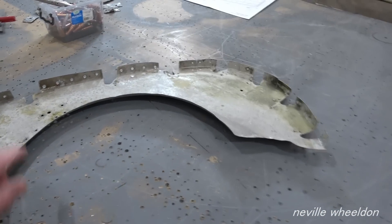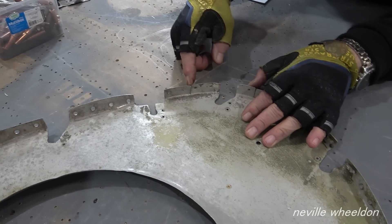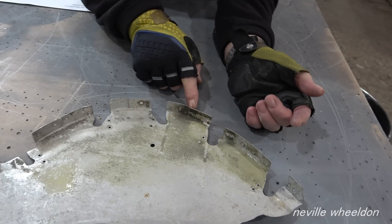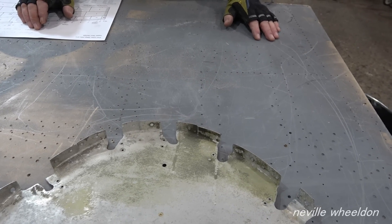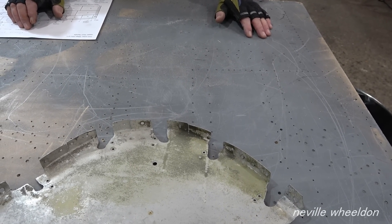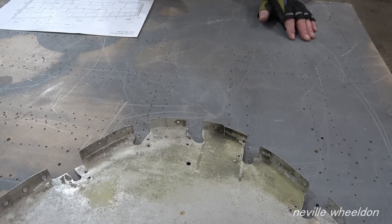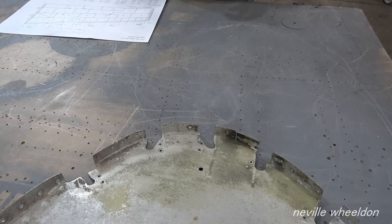So you see where the slots are? They've put additional slots in — see? Because you've got to try and lose the material as you're shrinking it. Fold it over. Although you're shrinking it together, it will take it to a certain point, and then you've crammed so much material it will just crack.